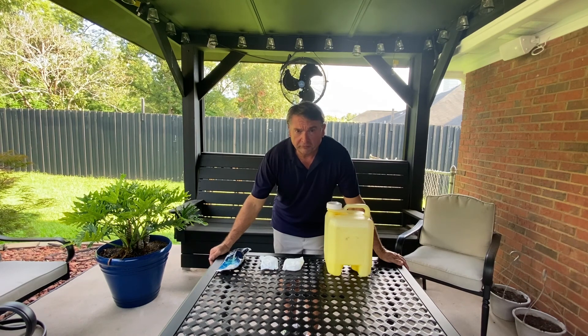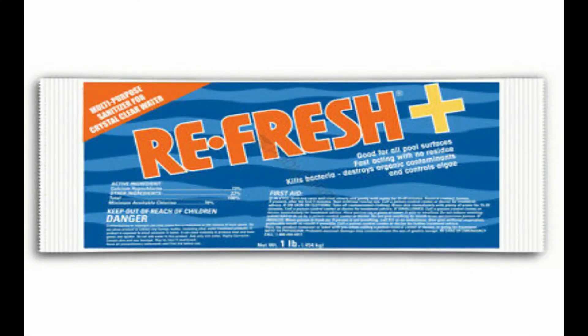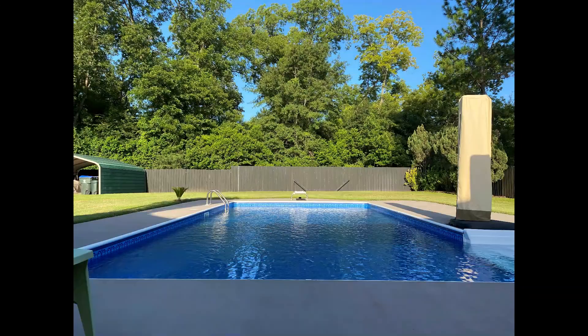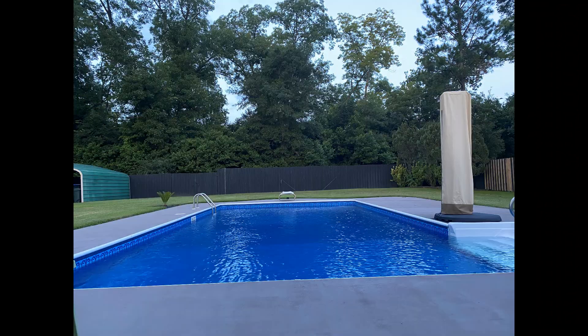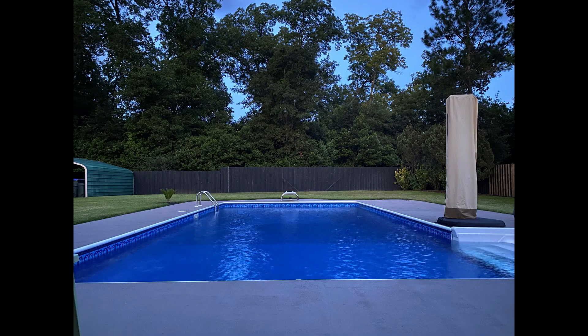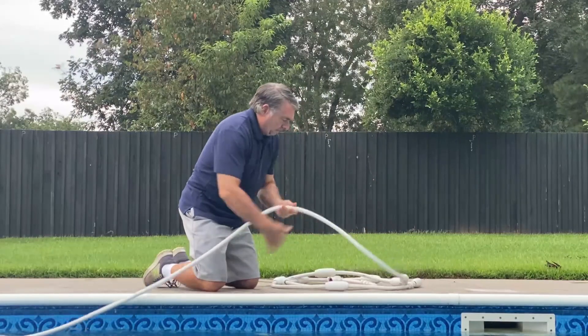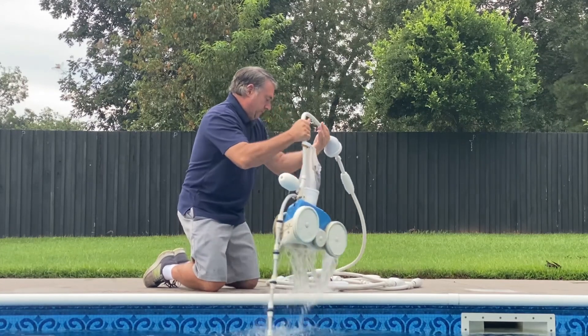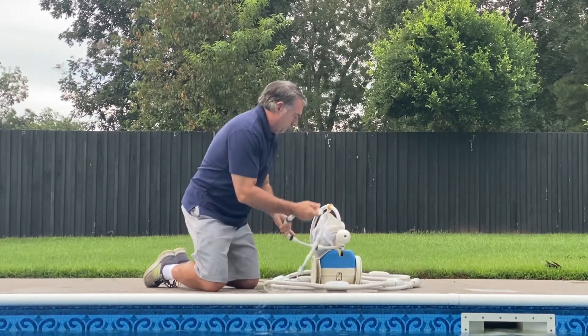Bad thunderstorms usually bring a lot of acidic rain, and this could dilute your pool water. Shocking the pool — also known as superchlorination — is a supercharged chlorine treatment that will kill bacteria, help prevent algae growth, and break up chloramines. Pool shock gets its best results while being applied at night; its power is short-lived and doesn't need to compete with the sun's hot rays while doing its magic. As with any pool chemicals added, I will refrain from running my pool cleaner and will continue running my filter pump until my chemical levels are back to normal.